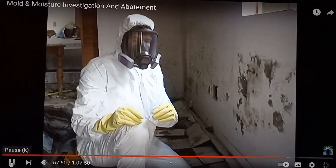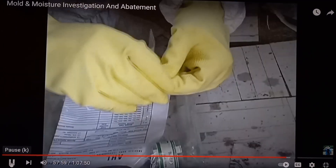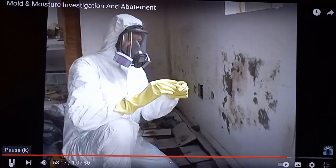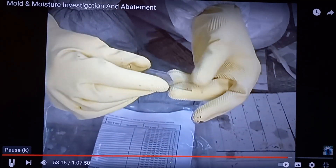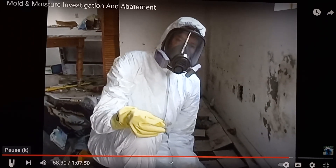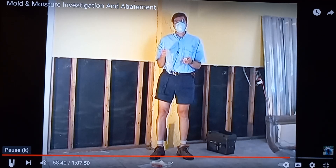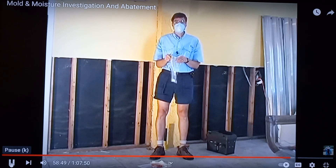You have clear cellophane tape on a microscopic slide. I'm going to take this tape, partially pull it off, and then lightly press it onto the area of suspect mold growth, pulling the seal down the edges slightly. Make sure you mark each slide with an indelible marker with a unique number that corresponds to an identifying number on the chain of custody. After labeling your samples, it's a good idea to keep all your samples together in one package — say a Ziploc bag — along with the chain of custody, and send that to the laboratory overnight.